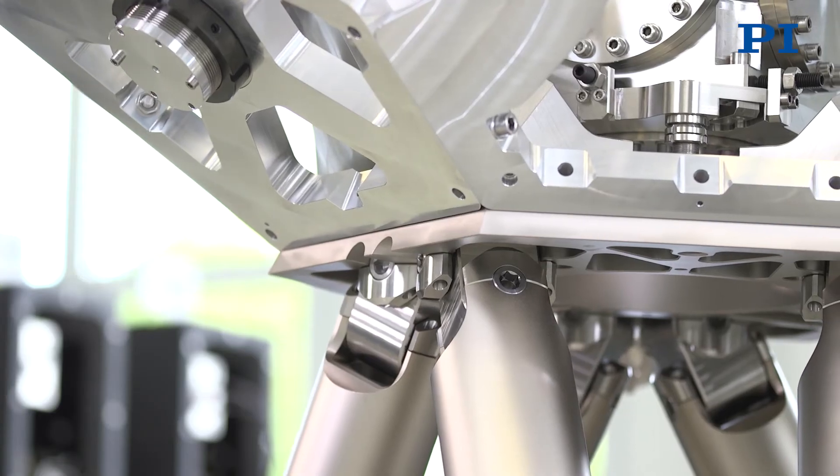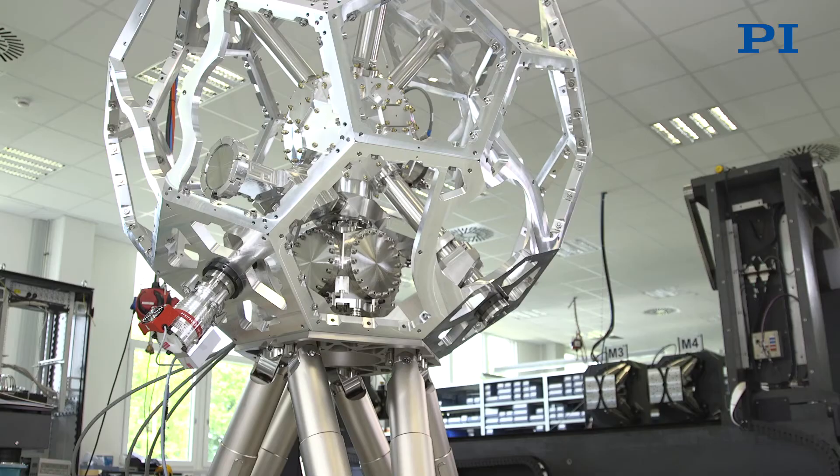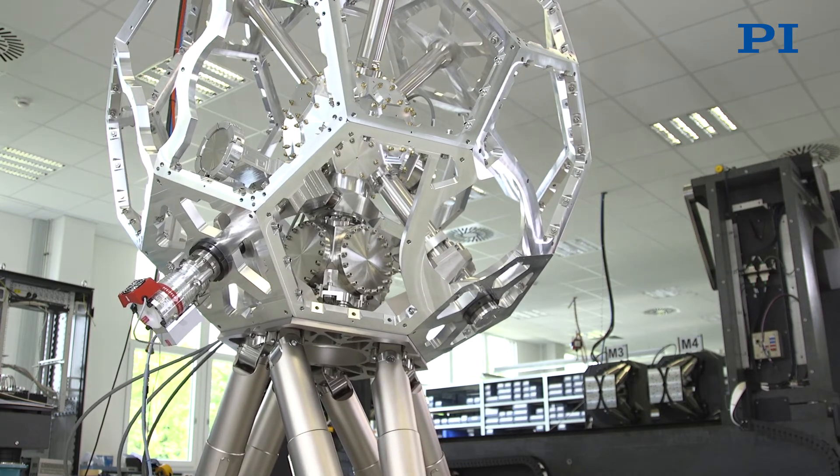How accurately does this work? If the sample is rotated around the X-ray beam, the X-ray lens will move less than a hair's breadth. The larger of the two hexapods has an angular resolution which is considerably less than 10 micro radian, and it is able to position two tons in space while remaining within its specification.